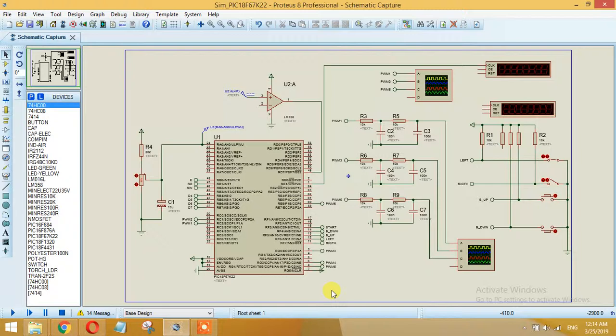The algorithm we are going to use is a voltage-to-frequency ratio method. The purpose of this method is to keep the voltage-to-frequency ratio constant, so that the output does not change the magnetic flux strength created inside the motor.